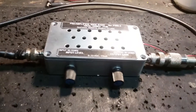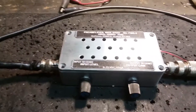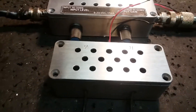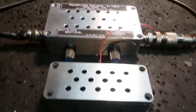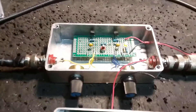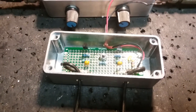We've been building dozens of these things. They're basically just RF preamps — nice and clean. What we were striving for is durability and the ability to not create overload at the front end, or intermod in your receiver. We tried all kinds of things over the years — FETs, MMIC chips, video ICs, which work pretty well — but none of them seemed to have the dynamic range and intercept points we wanted for a carefree, autonomous standalone preamp.